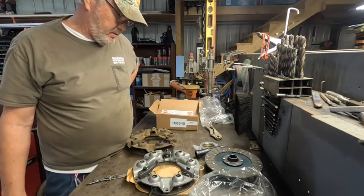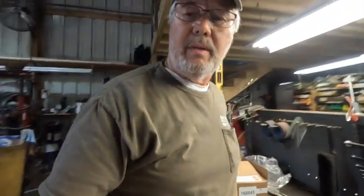I'm actually more excited about the tires than anything. We'll track progress as it happens. First I'm going to sit down and get this clutch on the back of the motor — the flywheel is bolted up and torqued down. I'll get the clutch on, lined up, and torqued. Then I may slide the two halves together, get the bell housing bolts in, and do the tires after — it might be a little easier once it's bolted back together. Let's make progress and get the old Farmall 140 going. We've got to plant a garden here in the next few days.